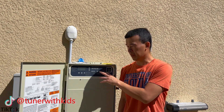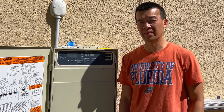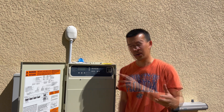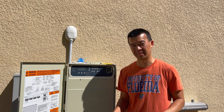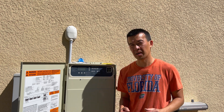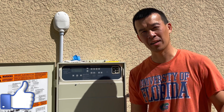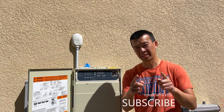Hey guys, thanks for joining me on this quick video on fixing the board on the Pentair EasyTouch. As you can see it was a two-dollar fix, which saved us probably $500 just for the part and probably another $500 for labor if you had to pay a pool contractor. It's a very common problem, especially if lightning strikes nearby — testing for five volts at those J20 pins will tell you whether this chip is your issue. If you can still use all the features manually but don't have app control or pump communication, it's that chip. Check the links in the description for all the parts I used. If you found this video useful give it a thumbs up, subscribe, and click the bell for notifications. Remember guys — if I can do it, you guys can do it. Thanks for watching.